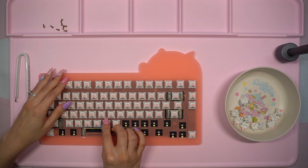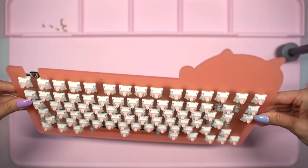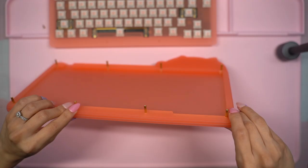I can tell the tape did a good job supporting the plate and I love that you can't really see it through the acrylic at all. To make sure no pins are bent, I plugged in the PCB one more time and pressed each switch while checking the results on a keyboard checker. Since everything looks good, I'll now be assembling the layers of the case.